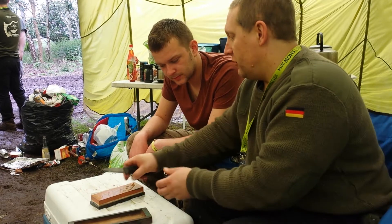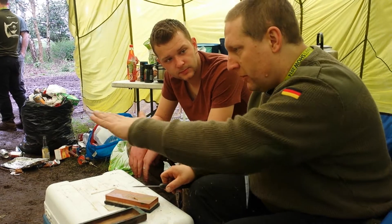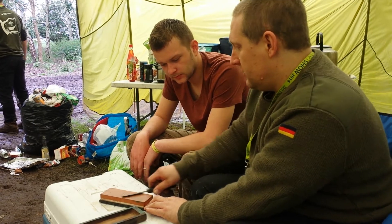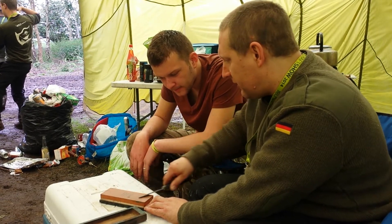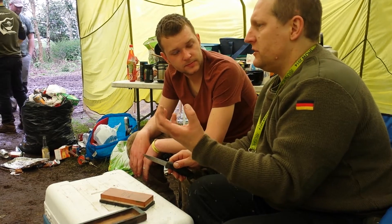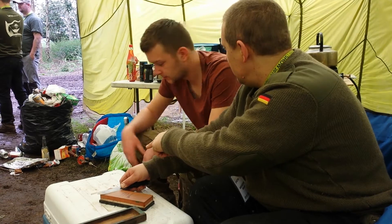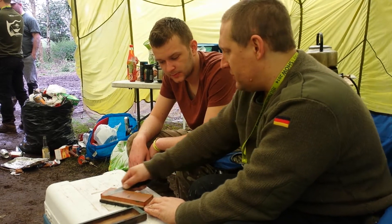Now in this case you could go one way only. What you're looking for is a slick sound. You know on the beach where you've got silt and sand in little black lines, where the finest sand has come up through and rippled and stayed in a certain spot? That's what'll happen here. And all of a sudden you should start to get it — it's not just black. That should be the steel, the grain in the stone. If you looked at it it was like egg boxes — you're filling the egg box holes up with this crap, so you're losing the peak differential between the bottom of the grit. That's why you clear the thing when you go back in the water.